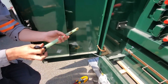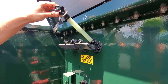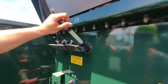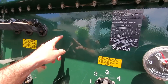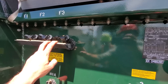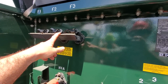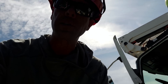So our next step — using our hot stick of course — you want to drop it in. When you're reinstalling these fuses, you want to slide them in slowly so the oil doesn't squirt out, and stop about three-quarters of the way in. This last little bit with your hot stick, you want to give it a good firm — almost like a slam shut. There we go — roll that shut. As soon as that locks in you're going to hear this thing come alive. Check for voltage on your secondary side — voltage should be there. Very good chance you might have a couple of those fuses blown, maybe just one. Either way, you do want to remove all three when doing this process. That's pretty much it for today guys — thanks to Miguel for helping us out. We'll have lots of stuff coming up soon. Thanks for watching, as always — be safe guys.